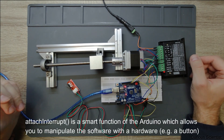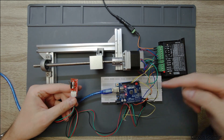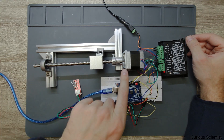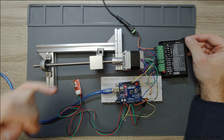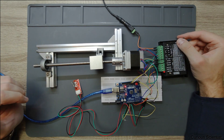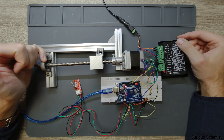What is tricky here is that I'm using the accelStepper library but I'm also using attachInterrupt, which means that whenever we have something from the outside — for example we press a switch — the Arduino immediately jumps to that code. Instead of tracking steps from the origin and moving back the same amount, I just define the origin or the limit of this structure manually.